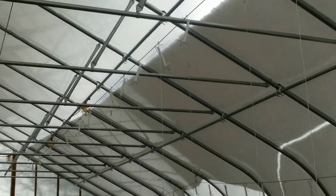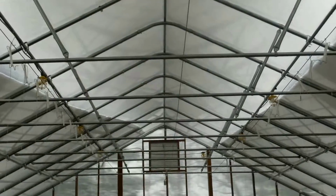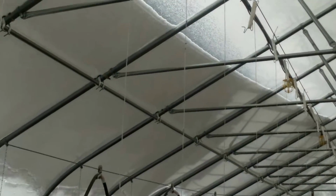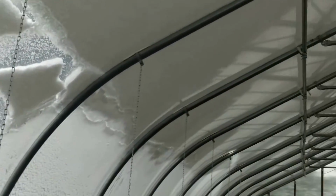Fortunately, 100 feet doesn't come the whole way back on the other run, so I want to buy a 50-foot run to double up on this edge here. Definitely use LED bulbs with these. The CFLs don't do well in the winter. Too slow to warm up.